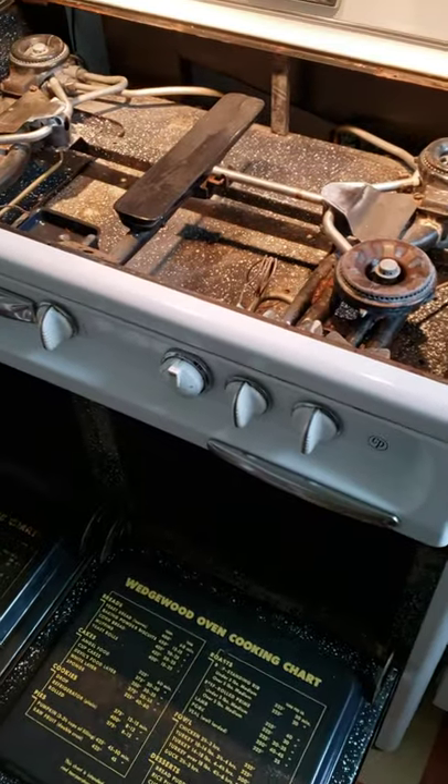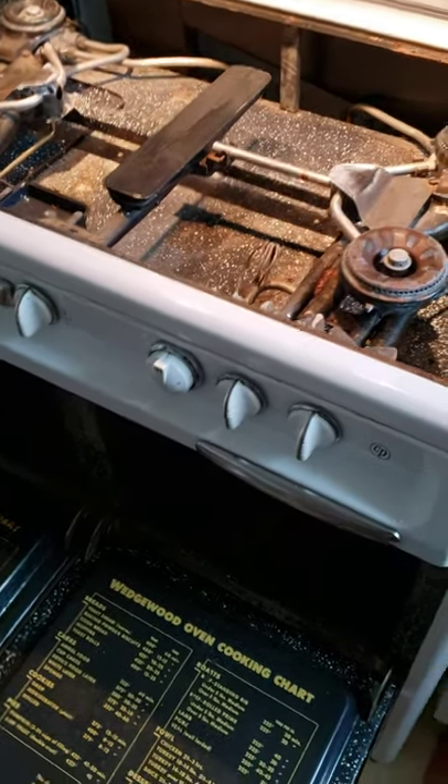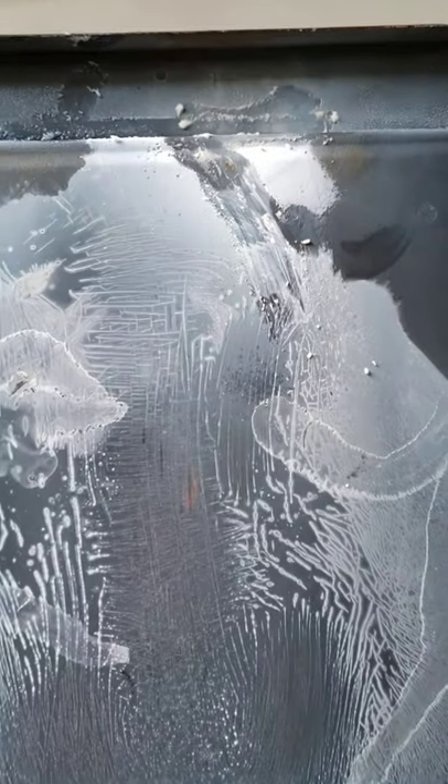We took everything out and talked to what used to be called San Jose Stove Works — a fellow there named Mark, who has since retired. He said there's white ash buildup which is causing the pilot not to be able to warm the thermocouple enough. We pulled out all the pans and underneath you can see — we washed most of it away — but that's the white ash buildup.